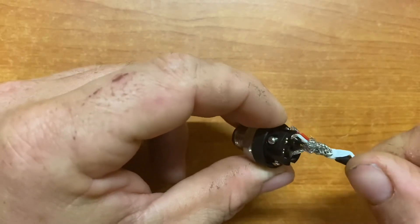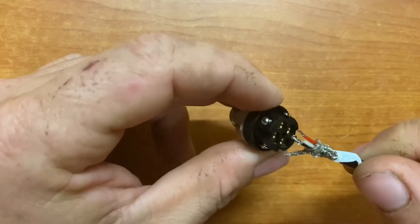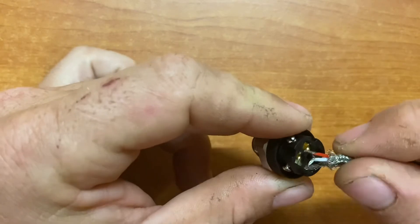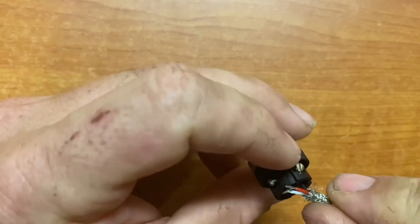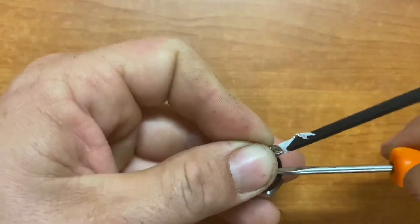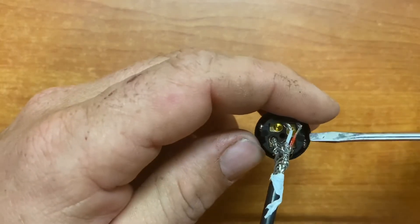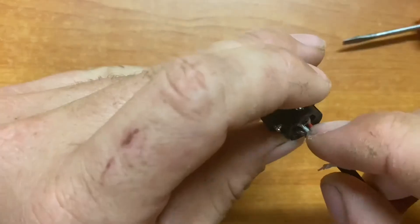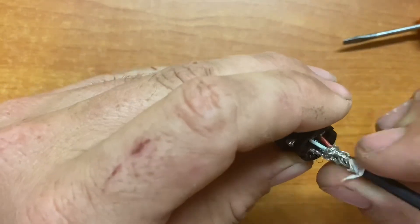We do the same process as with the soldering type. I've bared the shield wire and I'm using that first, making sure I've got a good connection. You want to keep your wires as short as possible outside the main insulation. The reason for that is the weather seal of the plug needs to have good contact on the outside of the wire, and you don't want any shield wire hanging out because if water gets in there it'll jeopardize the connection.